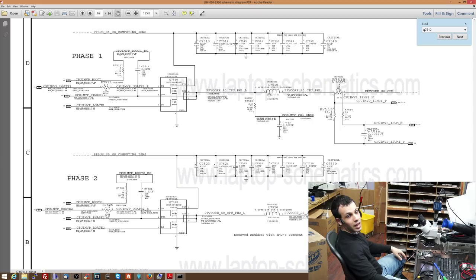That's a big overclock. This is Ivy Bridge. I honestly don't know off the top of my head if it works on 0.9 or 1.0 or 1.1, but the point is, I know 1.7 volts is way above what this is supposed to be working on. And every time you plugged it in, it was sending that PP-G3 hot signal direct to the CPU. Luckily, the charger is a little smart and knows to limit the power going in here if it sees that, or the PP-G3 hot circuit is, because if it wasn't, it would be sending 12.6 volts straight to there, and that would just be hell.